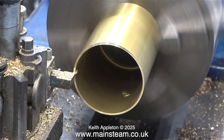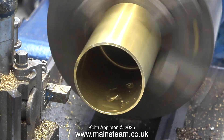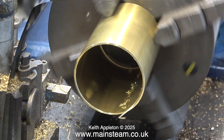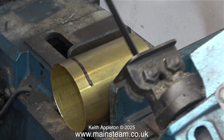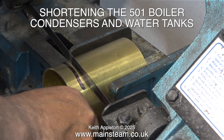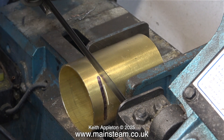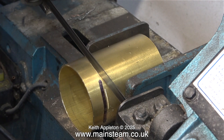The next part of the job is a little bit more complicated. Once again I have put a piece of brass tubing in the chuck and I am squaring up the ends, in exactly the same way that you have just seen me do. I am cleaning up the outside edge with a file and the inside edge with a deburring tool, and in no time at all it is looking good. You may have noticed the felt tip pen mark on this particular tube. Here it is in the bandsaw — I am shortening the 501 boiler condensers and water tank to match the boilers. I am using my bandsaw very carefully, and the first problem is the tube is rotating in the vice part of the bandsaw.